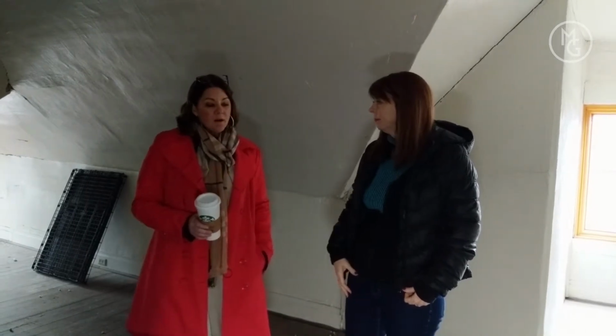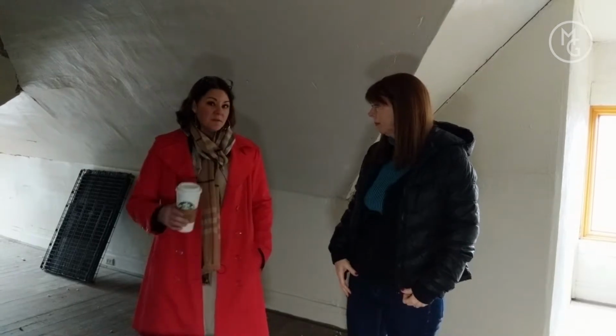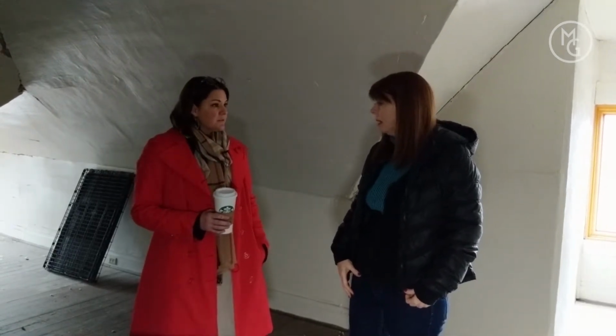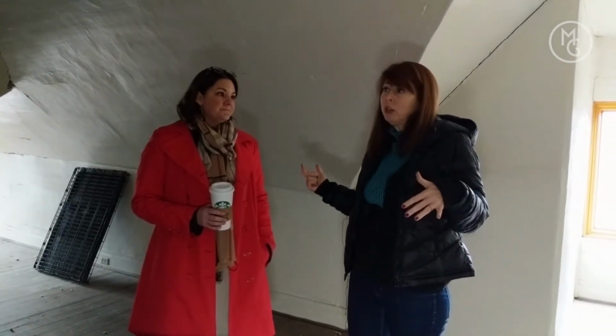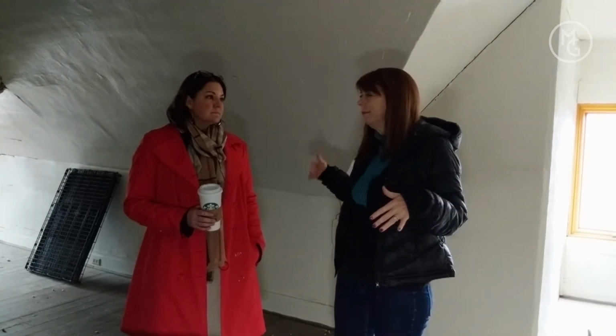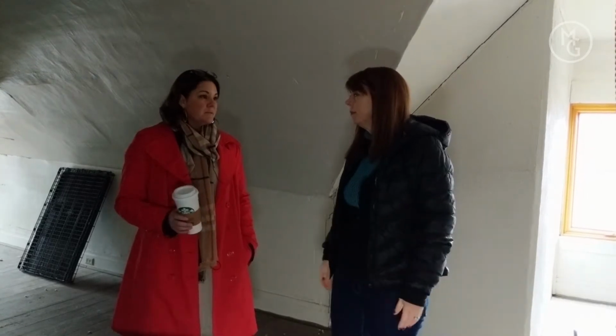So then the other option is the electric baseboard heat, which can be costly to the renter because electric baseboard is expensive. And what was the third option? Extending the existing ductwork to come up here. But we have air conditioning, and there's no way I'll be able to get an efficient return, so that may impact the efficiency of the entire system. So probably a mini split would be the best.